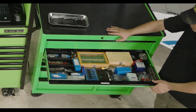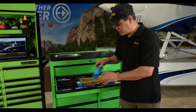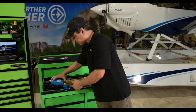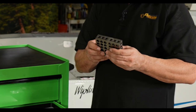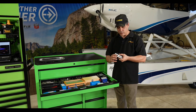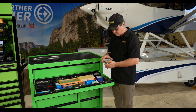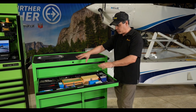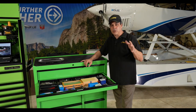The next drawer has a lot of the milling and lathe tools. We've got a lot of our end bits, gouging bits, all kinds in here — end mills and things of that sort for taking down stainless steel or aluminum. We've also got router bits. These are our one-two-three blocks, which are a must-have for precision work — basically one inch this way, two inches this way, three inches this way. You can attach them to different things, but that's a whole different video on precision milling. Here are our milling heads, Allens for the milling equipment, and lathe bits for making grooves or cutting ends. Check out our video on the mounts we built for the aircraft.